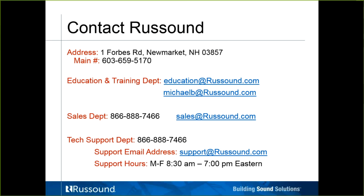I'm going to answer it in two different ways, and it really depends on the situation. If it's a streamer in a source mode, so either an MCA88X, the built-in streamer of the MCA88X, or an X source being brought into an MCA in a source mode, then yes, one streamer could be doing something and all zones could tap into that one source and listen to it. A party mode in that sense would be: I'm in zone number 1, I'm going to pick the streamer, I'm going to start my Spotify account, okay, I've got Spotify Connect going now, and now I'm going to put the whole MCA system in party mode, which will turn on all the other zones and force them to the same source. Then yes, at that point, all the zones would be able to listen to Spotify Connect.